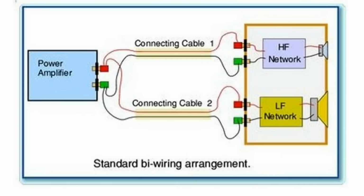Yeah, they're all high. Before we get into the claims, let me tell you the truth behind bi-wiring. Bi-wiring does change the impedance slightly that the amplifier sees from the load. The reason it does that is you have two sets of cables interacting with the load instead of one. So the impedance changes slightly, and we have articles on this for all you propeller heads. I've done the math, we've done simulations. You can see the very small, minuscule differences that bi-wiring causes. Definitely check out the links over here.